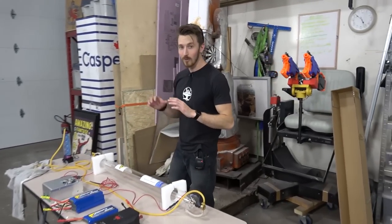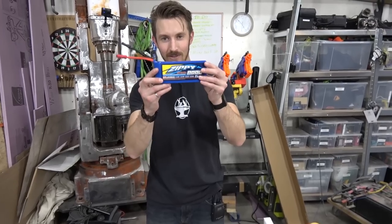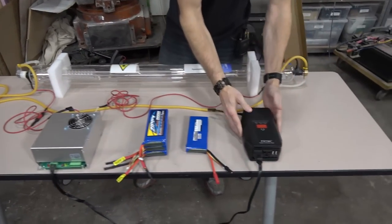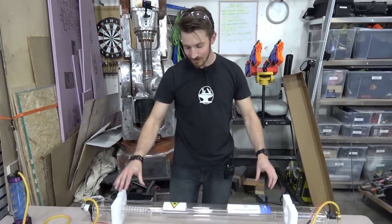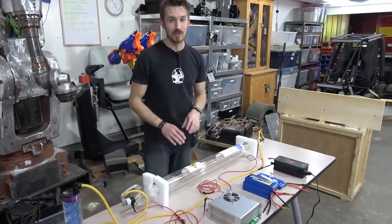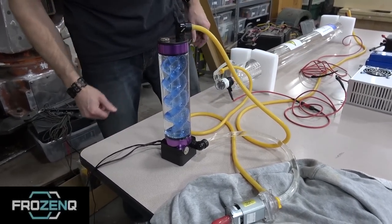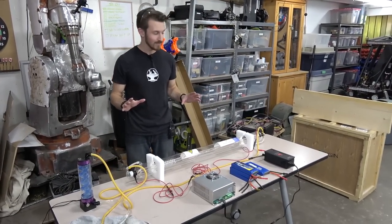So we've got all the components we need for building Zarya's particle accelerator. We're actually powering the entire thing off of this small lithium polymer battery. The power supply for the laser is AC, so we're actually going to be using this power inverter to take DC to AC. And then this actually outputs up to 35,000 volts to the laser tube, which causes the laser to fire. Even though this laser tube puts out 80 watts of laser power, it actually takes over 400 watts of input power from this power supply. So there's a lot of heat loss, which means we actually have to water cool the entire system. To do that, we're using a frozen Q reservoir, which is actually used for computer water cooling systems. But enough talking about it, let's fire up this laser.